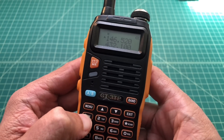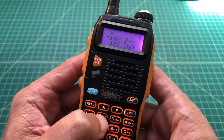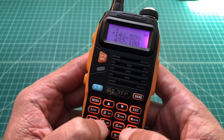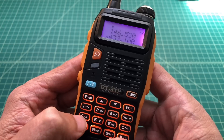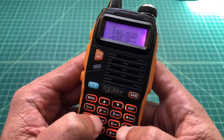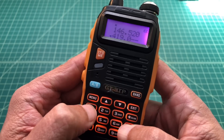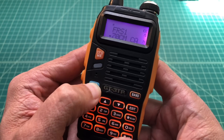Here you can see from the keypad: based on the upper and lower limits we set for UHF and VHF, I cannot type in frequencies that are outside the amateur radio spectrum bands. I'm also prohibited from transmitting on any frequencies programmed into any of the memory slots or channels. These restrictions will persist through a factory reset, which is pretty handy for making sure your radio will not accidentally transmit outside of amateur radio spectrum.